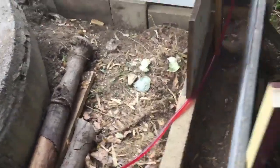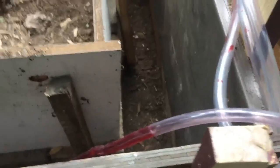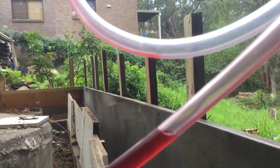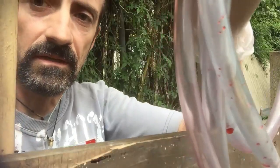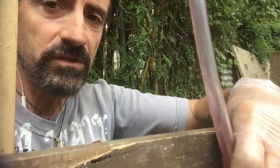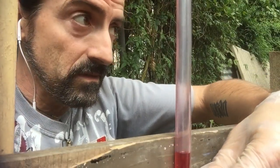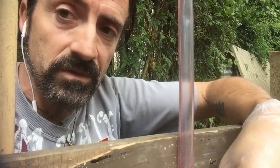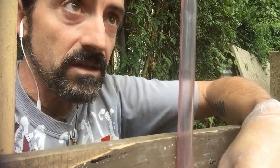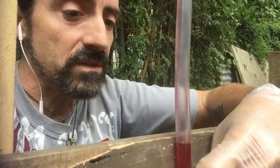It goes all over the joints as long as it's lower than your initial point. At this end you basically grab your tube and raise it up and down to check your level. So if I hold my water level here I keep all my tube up above what I've got. The more tube you let down the lower the water level will go, because you've got more tube for the water to fill up. So if you raise up your tube, go slowly because you've got to let the water level settle.